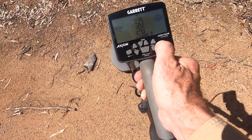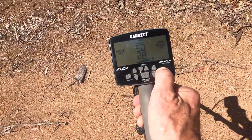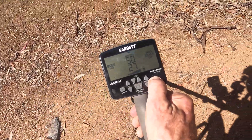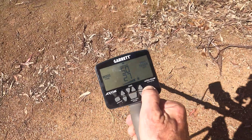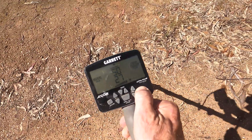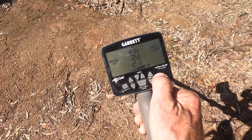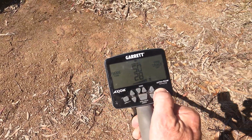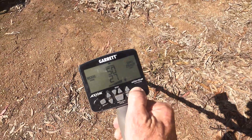That's it. Now I've still got the button down and I'll show the machine as much ground as possible. What it's doing now is reading the ground and adjusting the ground balance window from zero to two, four, or six — plus or minus the median value. As you can see it's not varying much. I've got the ground balance reading there above the 50, which is the upper ground channel, and 27 is the lower ground channel.